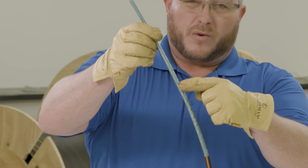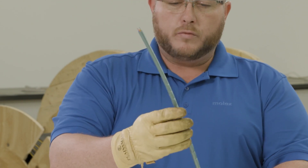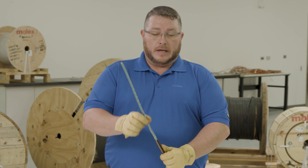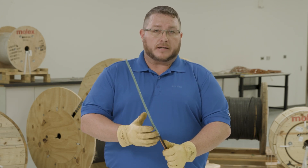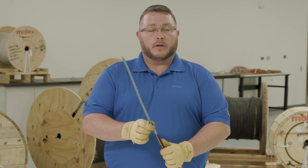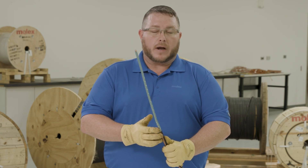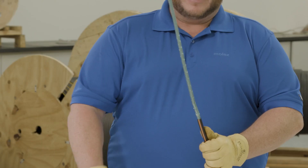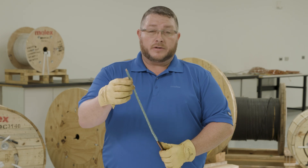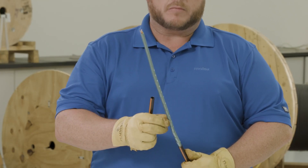You'll also notice that where I opened it originally, I didn't cut through the shield, because we use a high-grade aluminum shield. Now that we have the jacket removed, you can see we've exposed the shield. In a single jacket, single armor, direct buried application, we need to be able to apply some form of bonding clip to this cable. With ready access to the shield, you can use virtually any bonding clip that meets your criteria without worrying about chiseling the shield out of the jacket. The releasing agent is petroleum-based and designed to allow easy removal of the jacket as well as serve as a first line of defense for water blocking within the cable.